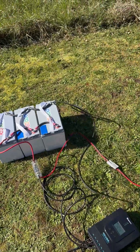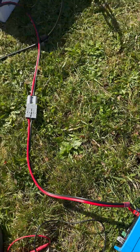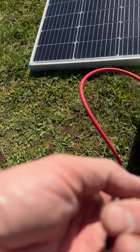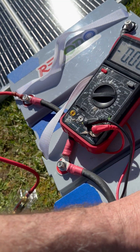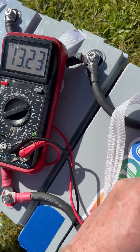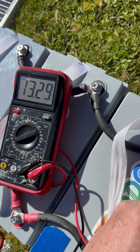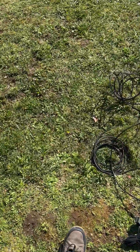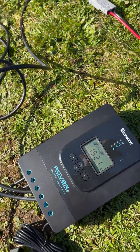There's a little bit of load there. If I go ahead and shut this off, we should see a spike in voltage — this thing should start coming up more. Yeah, it's slowly coming up here: 13.24, so it's come up a tenth of a volt and it's going to work its way up. This is charging nicely — we're still putting 15.21 amps into the battery.